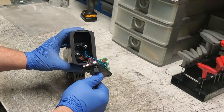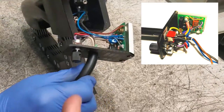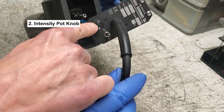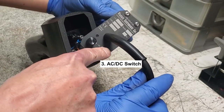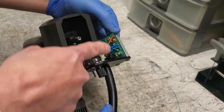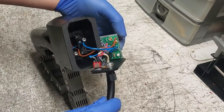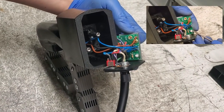You can see the control board on it. We have a control board that's mounted to a heat sink over here. We have the pot — the potentiometer adjustment — and the AC or DC field. On this board is a potentiometer that we have to adjust to make sure the yoke just lifts 50 pounds. You can see the potentiometer back there — the white one.